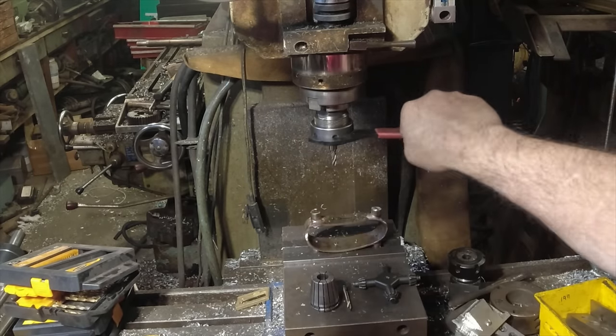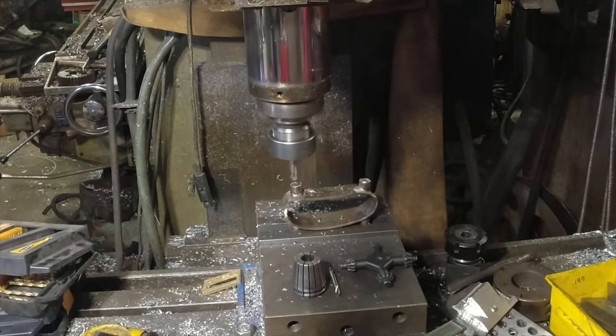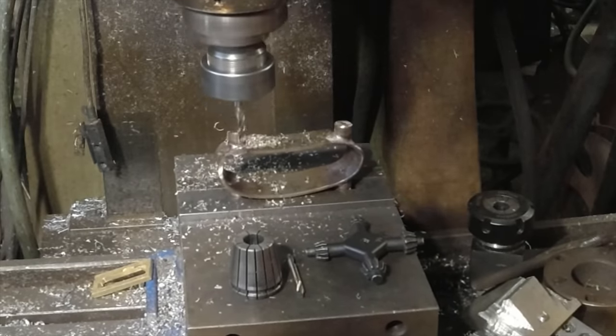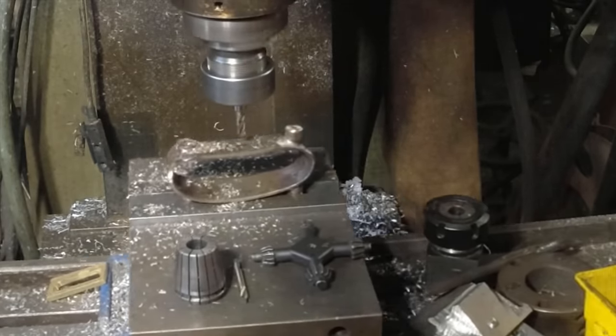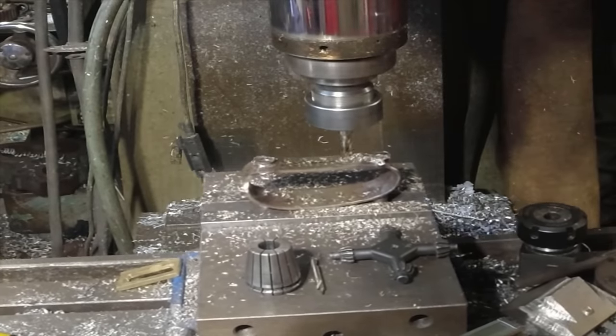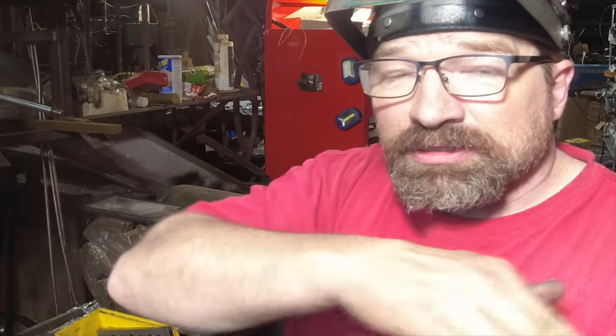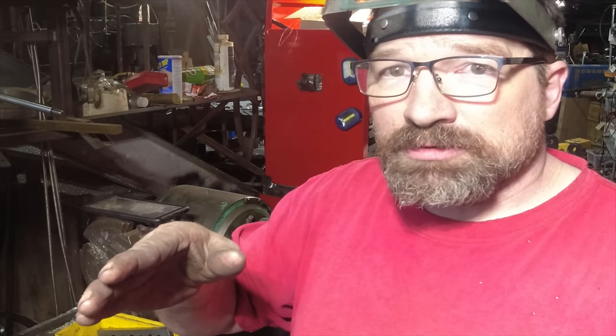Now that all the holes are drilled, I'll switch tools to a quarter inch carbide end mill and plunge mill the excess of the bosses from the palm side of the socket. I plunge mill these parts because it allows for a high rate of material removal, then I finish by planer milling the surfaces parallel with each other. That gives us two planes that are flat in two axes. From here I'm going to flip it, tap those, then flip them over and bolt them from the underside to a block that I'll stick on parallels in the vise, and then I'll be able to machine the top so everything will be parallel to each other — both the inside ones and the outside ones.